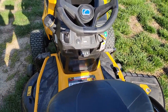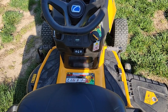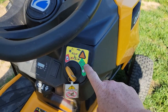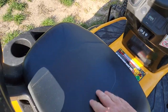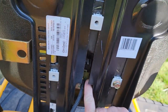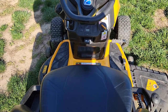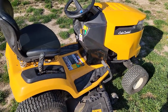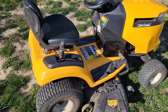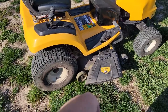This is what the control panel looks like. If you've ever tried to go in reverse and the engine dies, or if you want to keep the blades engaged, I'm going to explain these controls. It has a micro switch in the seat so anytime you get off the seat the engine dies, but there is a way to keep it running. About ten years ago they started making these mowers extremely safe — it basically disengages and dies once you get off.